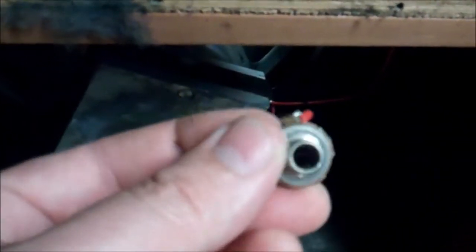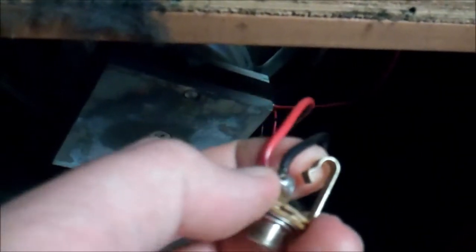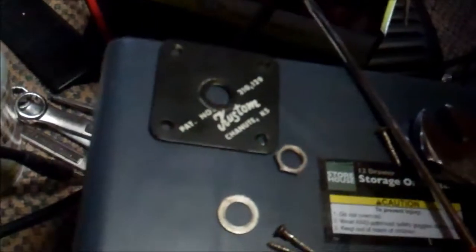We need to polish inside there because that's where the negative terminal grabs on the ring, and then the tip of our quarter-inch jack. It was mounted on the plate down there — there's the plate. And there was a tooth washer in there to keep it from rotating and turning. We'll put all that stuff back in and put it back together.